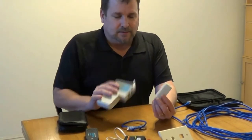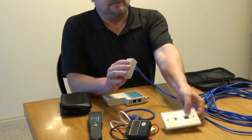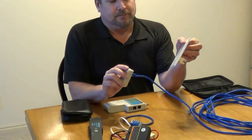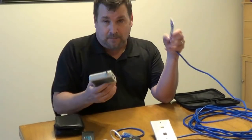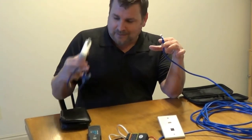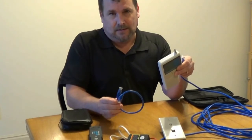All testers come in two pieces. You've got your dummy end, which goes on one side. I would plug this into the room — get a little patch cable to go from the jack to the dummy end. That's your connection in the room. Then you go into the closet and take your patch panel and plug into that. I keep a patch cable inside this kit because the tester is female and a patch panel is obviously female, so you would need a patch cable to connect them.